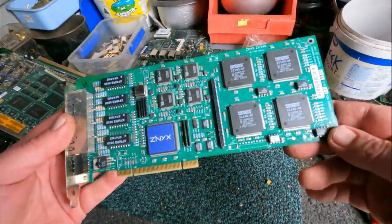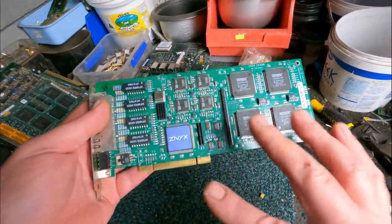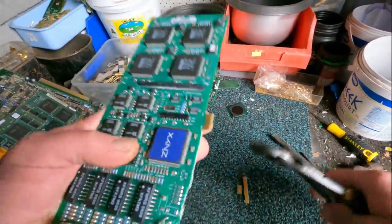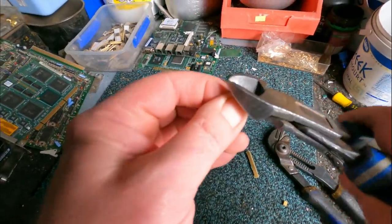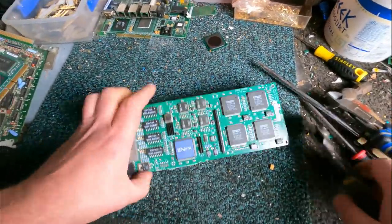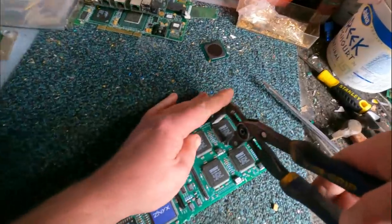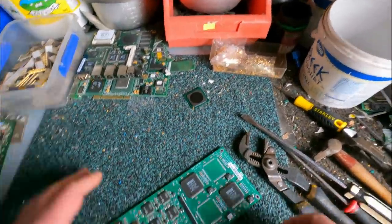We've still got a pretty good board here. What I think I'm going to do for the video's sake is bring this down to a mid-grade board. If we're going mid-grade, I'm going to take off the gold fingers. I find this method of taking off gold fingers is just the easiest way as you go along. Ideally you don't let your stuff to depopulate build up too much - you just do it as you go. Now obviously four chips for a mid-grade is way too much, so for a start I want to grab two of these flat pack chips.